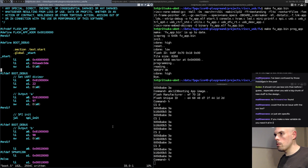So I've just added this to the boot code as the absolute first thing the CPU is going to execute. Now obviously, in reality this could never work because I haven't done the memory training yet, so I can't really talk to the HyperRAM yet, so the write wouldn't succeed, but oh. Yeah, you know what? Before I actually try to debug that,